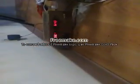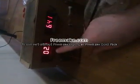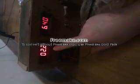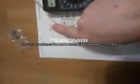Now, let's change the voltage on it. So try different voltages. We can decrease it or increase it. Now look, you might see over here, over this side, why isn't it 2 milliamps? That's because we just turned it down so low that there's very little resistance on the pot. But that shouldn't be a problem because this resistor here will protect it from drawing too much. And 2 milliamps is not going to do anything to the circuit.